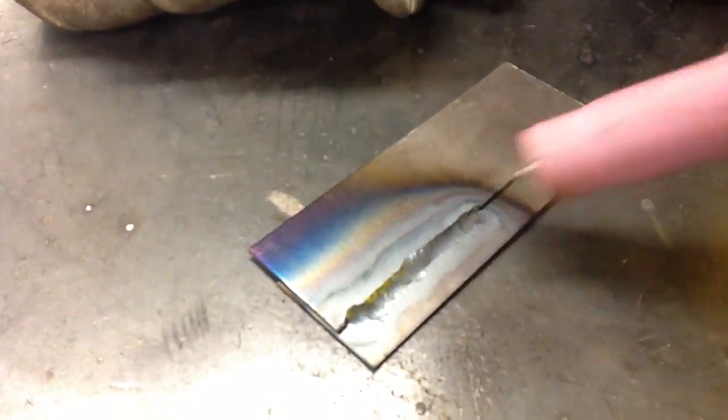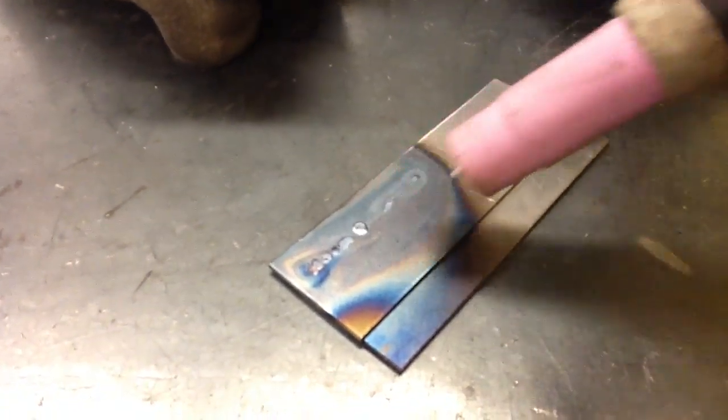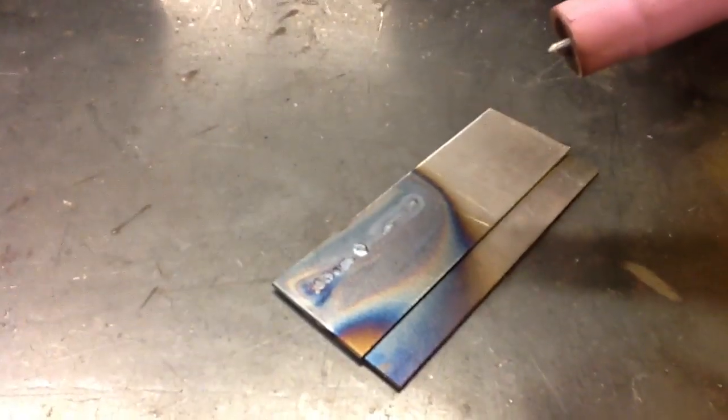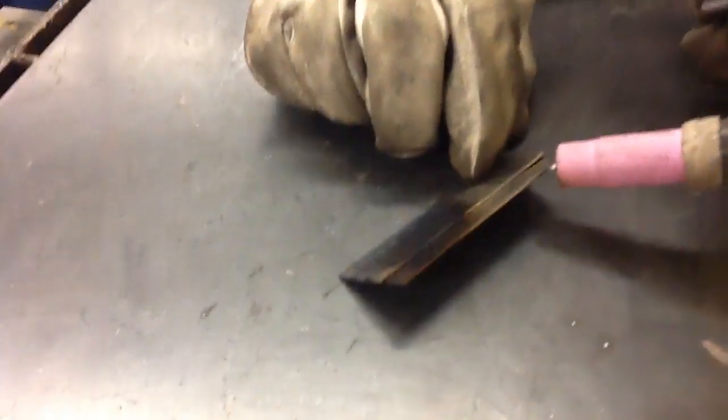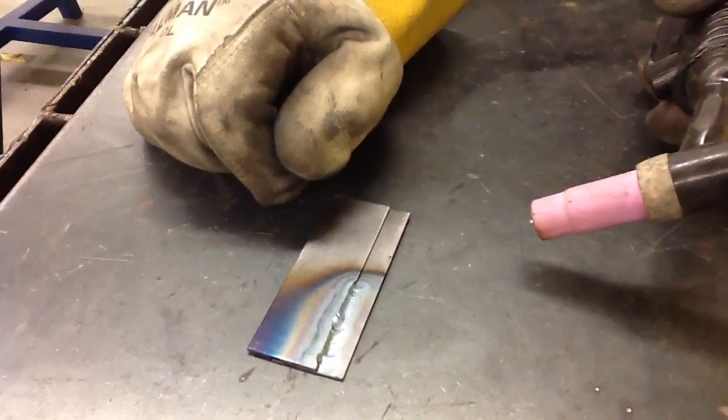What I'm looking for is some uniformity. I got really nice uniformity through the second part there — you can see I was waving a little bit at first, but it didn't move too much. I didn't have to spot the other side. If we look at the other side, we've got pretty much maximum heat penetration. I'm getting away with using the table as kind of a backer, because that one piece is on the cold table so it's not typically going to burn through. But where you see those spots — if that was sitting up in mid-air, it might burn a hole right through, and then we'd have to dial it back or use even less heat. We want you to weld this full through all the way from one side to the other, and you can flip it over and try the other side too. Then we might do something with a filler rod as well.